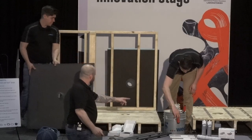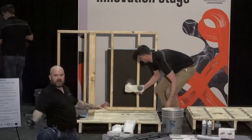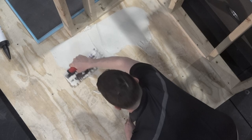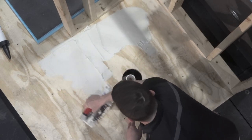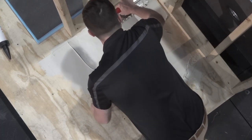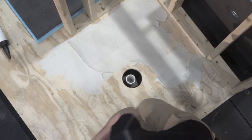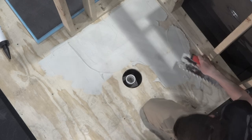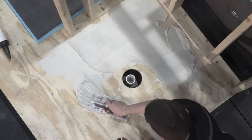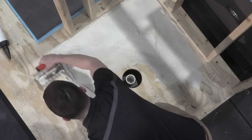We're going to go ahead and get this thinset down. Steve's keying in the back of the base — back-buttering it with the flat side of the trowel. The plumbing prep in the floor is really simple. For the Primo shower base and the linear drain, your prep is going to be a five-inch hole in the plywood. If you're installing on a slab, it's also a five-inch hole, and the pipe height is just flush to the top of the plywood. We're talking PVC pipes, ABS, cast iron, and we even have adapters for copper pipe. P-trap, flush cut, five-inch hole — you're ready to rock and roll.